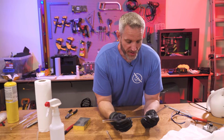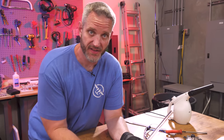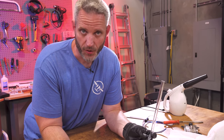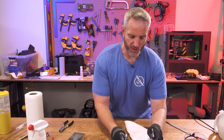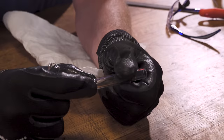So what I would do now is bend it first, and then I would chop the ends to be the length I need them to be. The thing that sucks about glass versus acrylic or PETG is you can easily trim plastic and acrylic — notice I said acrylic is not plastic because it's not. If you screw up and you score it wrong and you snap it wrong, then that bend is wrong because you have to do the piece again.